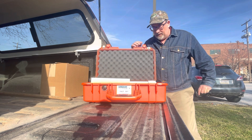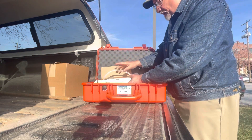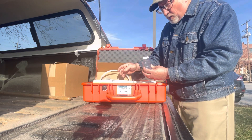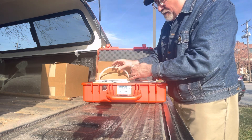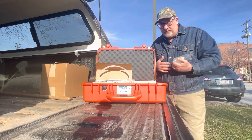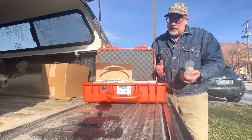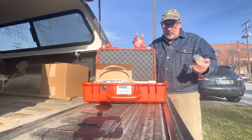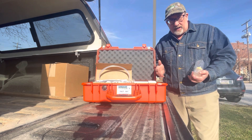Let's look at what's in the kit first. We've got a Grease Thief Box here, and inside you've got a number of different tools. You have some bottles that you can use to capture oil — liquid oil samples — in a couple of different formats. You've got some tubing in case you want to gather oil from the housing or from the reservoir that the filter has been drawing on, maybe upstream and downstream of the filter before the filter is removed. It's kind of a filter efficiency test, and you have a number of bottles here that allow you to capture that.